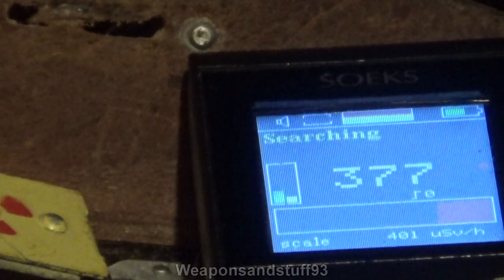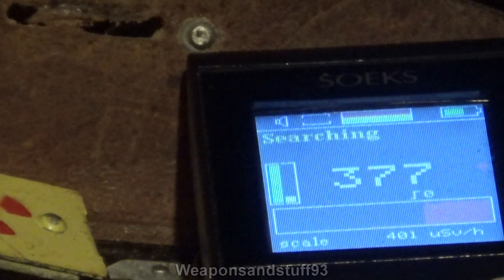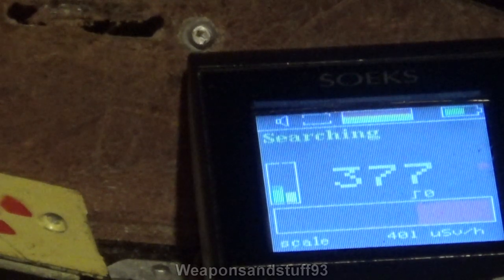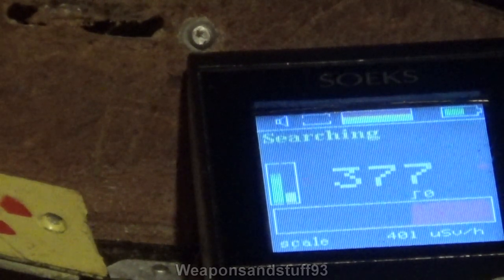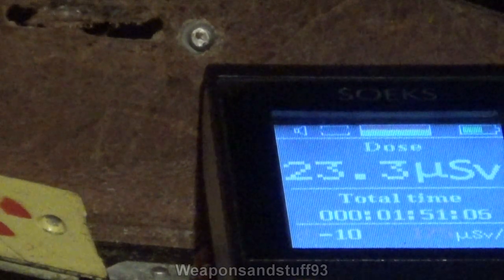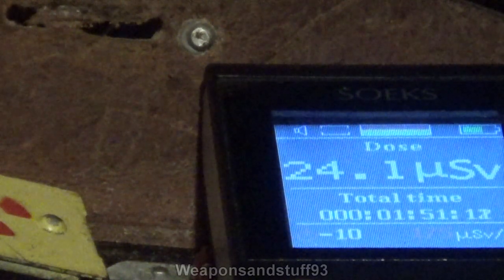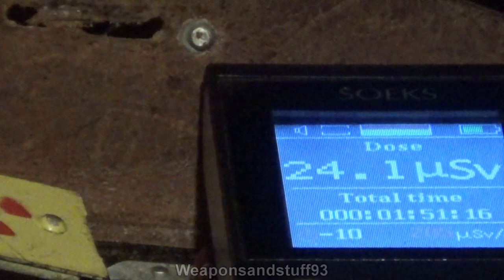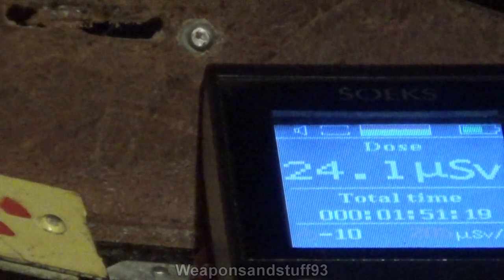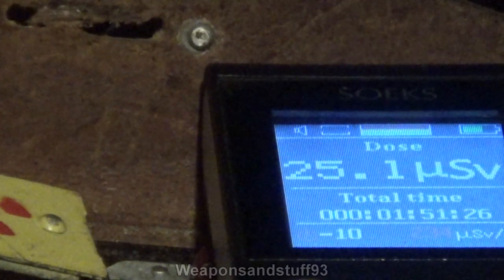377. I'll let it go for a bit longer, and then I'll show you with the Polish Geiger counter. 377. I don't know if it's going to go higher than that, but that gives you some idea of just how crazy that number is. What does it think this is in Sieverts? Let's put on Dose mode. We'll put it back on there and look at the Dose number going up. You'll probably keep seeing the Dose shooting up. There we go, it's moving. If you see how fast that's going up, I think that's microsieverts — or millisieverts. But yeah, that is pretty high if you can actually see the millisieverts number going up like that, not going up by points but essentially going up a full value each time.